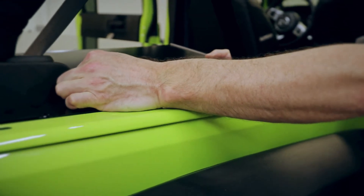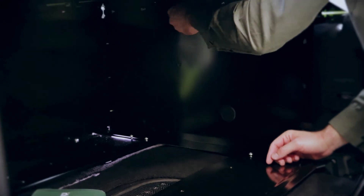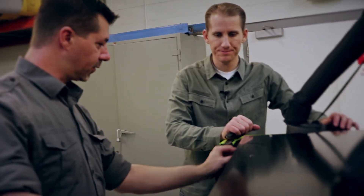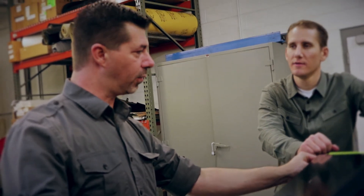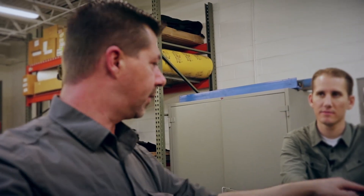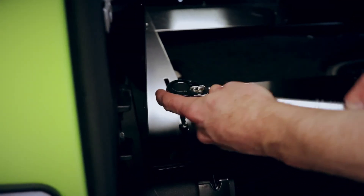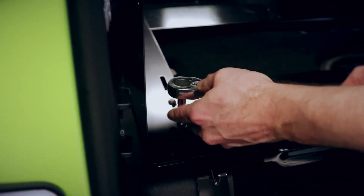I'm going to hold this in place as Tyler starts our bolts. I mentioned earlier to keep the surround bolts to the base plate finger-tight, and the reason is now that we have all the wings in, we're going to try to get a nice even gap around the support bar — just simply move it around until there's a nice even gap, nothing touching, so we don't damage any bezels. Then we'll go ahead and torque these down. Now everything is nice and tight — the base plate is tight to the floor, the surround walls are tight to the base plate, the wings are tight, everything is nice and solid.